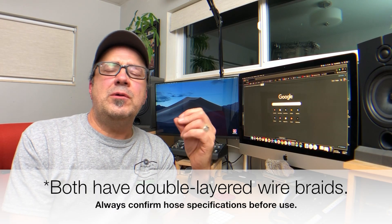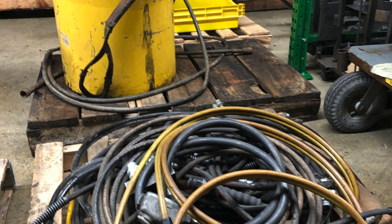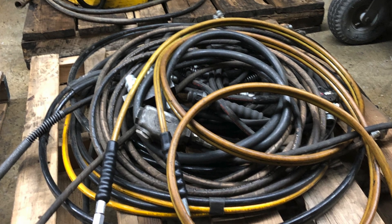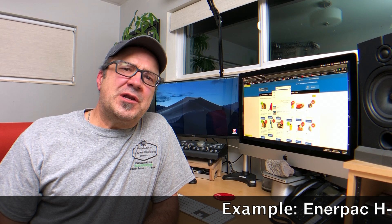Rubber is very pliable but it can get brittle in very low temperatures. Poly hoses on average are about 40% lighter, which can be very important when you have lots of hoses or long hose runs — 40% lighter can be a really big deal. Poly hoses have great abrasion resistance, can be bonded together such as in twin torque hose lines to keep a workspace tidy, can have a smaller outside diameter, and can be manufactured in different colors. That's a lot of pros for poly hoses, but they do come at a price — on average about 30% higher.